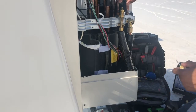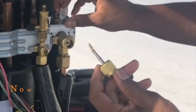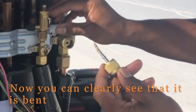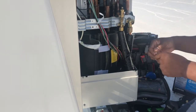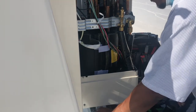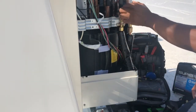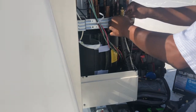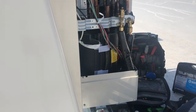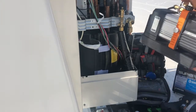If there were no pressure I could just use the tool and take it out alone without needing the removal tool. But since it's bent, I am going to replace it. As you can see, I released the handle — there's nothing in this system now because I already let the nitrogen out. It's good and tight on there, so now I'm going to get my vacuum ready and change the oil in my pump real quick.